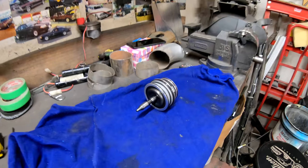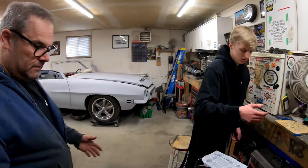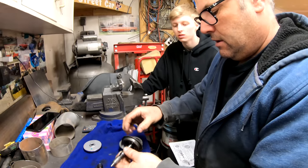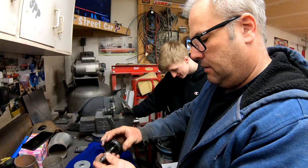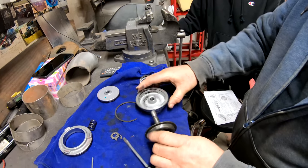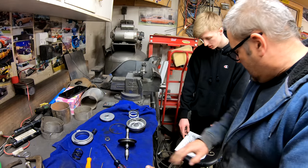I usually like to set everything on the bench in the order it came out. There's this little ring, this washer, this spring, and then this just comes out. We could probably have made it easier to get this ring off had we done that in the first place, but that's okay. To take this piston apart there's just a ring in there that holds it. We had to put it in the vise and use vise grips to get it apart. Now we have to add a spring to this system and then put it back together.